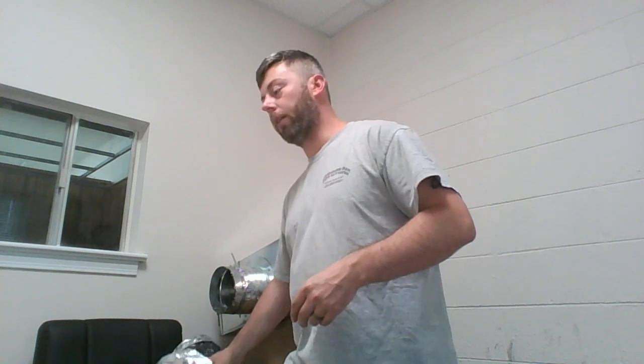Okay, so we've got to cut it off. Now, rules of thumb, I think I just went over one: you don't want it too tight because you've got to pull it up. The second one is you don't want it too loose. If it's too loose, you're going to have dips and bows in your ductwork, and that's creating inefficiency within the system. Air needs to flow as straight as possible without catching resistance anywhere. Those dips and bows are resistance across the system. So don't be too loose, don't be too tight. It's like the Goldilocks zone of tying in ductwork.